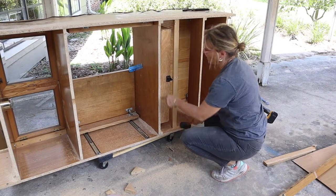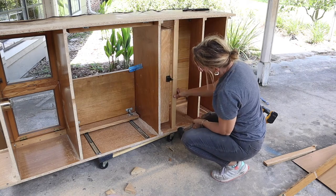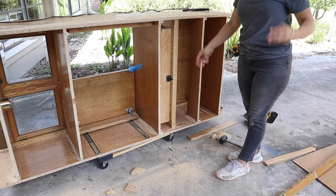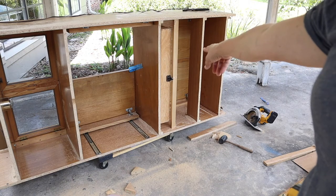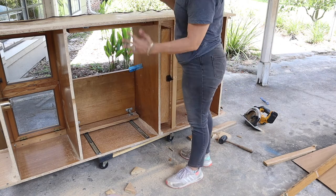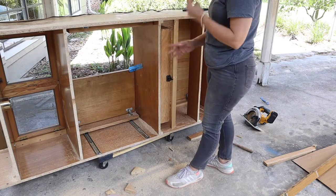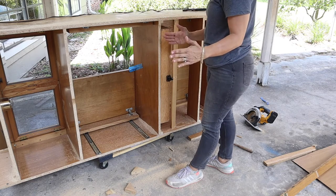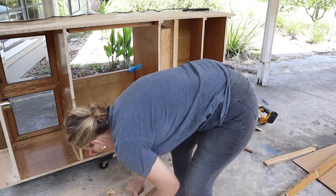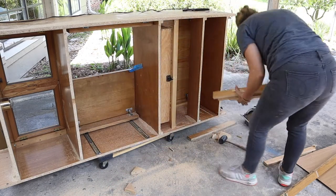This is one of the pieces that came off the back. I'm going to fasten it here in order to be able to fasten the drawer to it. I'll put a screw in there and a screw there. I'll have to use a metal bit to drill through the drawer slide and put a screw there. Then I'll stand it up and see how wobbly it is — I'll probably have to put maybe a couple of braces, like one brace here and one brace here. This cabinet sits in between two of the other cabinets, and I'm going to fasten them all together and fasten them to the wall, just for safety — you never know in the future who might be trying to climb those shelves.